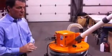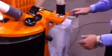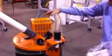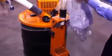As far as safety goes, every system we have includes an activated carbon filter that filters out the mercury vapour that you don't want to be exposed to. As you're crushing your lamps, negative pressure is created by a fan system that draws the mercury vapour through the activated carbon filter.